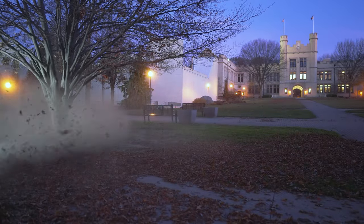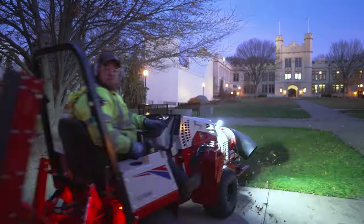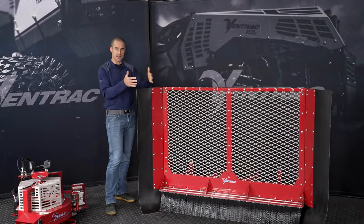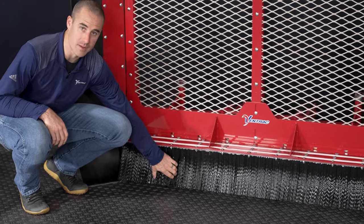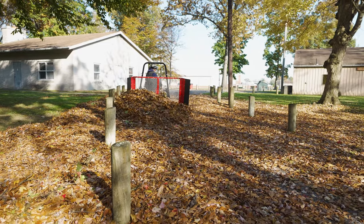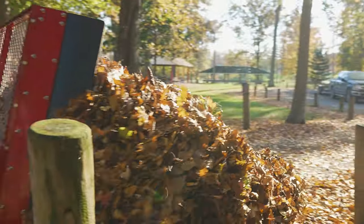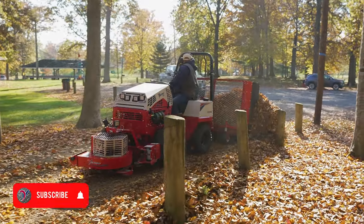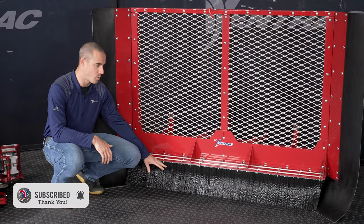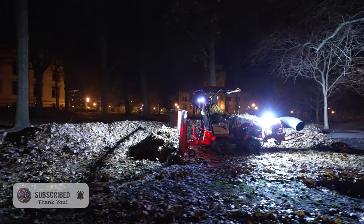There really are no accessories to go over on this — both blowers have the light kit as an accessory, but this just comes as it is standard. It has flexible rubber wings that are strong enough to keep leaves contained inside the plow, but not strong enough to destroy trees, posts, or anything else you might hit with them — they'll bend away and flex. Underneath, there are bristles. This is a pretty critical design element: you don't want a hard edge like a standard plow, and some metal tine bottom rakes on the market have enough resistance to peel sod up as you work. These bristles are specifically formulated to be soft enough to give way and protect what's underneath, and they'll glide over roots in tree areas without obstruction.